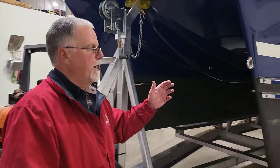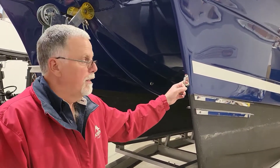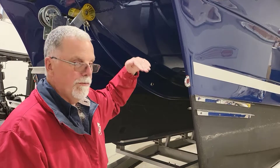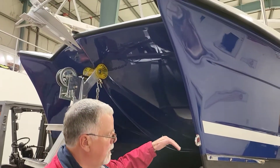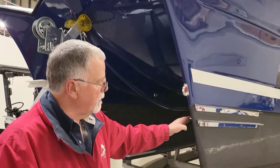This customer has a larger yacht and he's going to tow with these towing pintles. You need to tow from down low — if you try to tow from up high it makes the nose come down, which causes bow steer and it doesn't tow as smoothly.